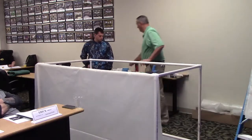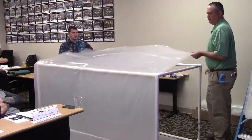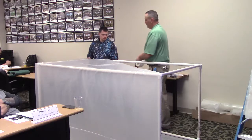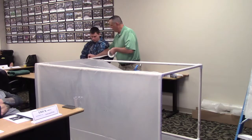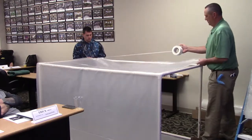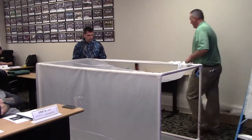What type of plastic should we be using? Six mil. Fire retardant rating. And what is the fire retardant rating? There's no oil on it so the tape will stick, and the surfaces we walk on. Also, I noticed yesterday — I want you to stick it half to the plastic — we pulled it almost too tight and the PVC started to flex and bow. I'm going to keep that in mind while we're putting our containments together. Maybe it doesn't need to be quite as tight.